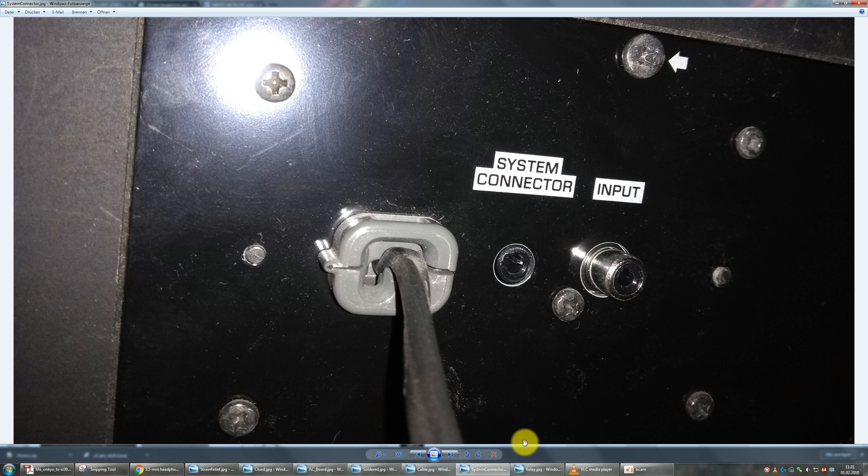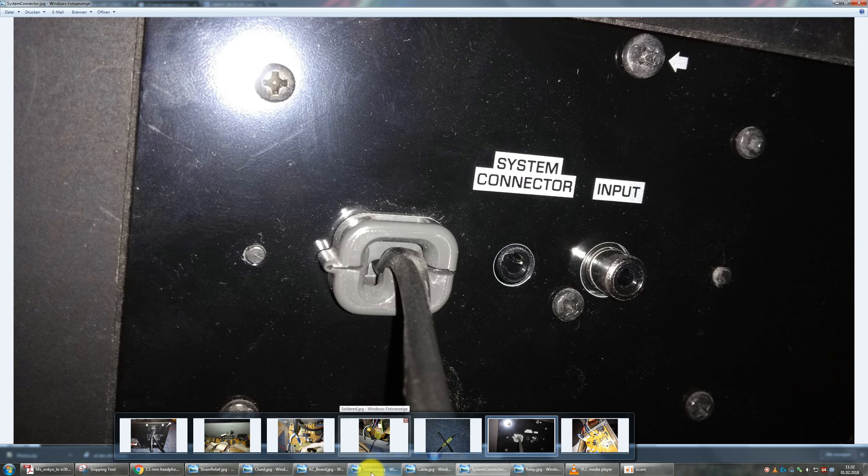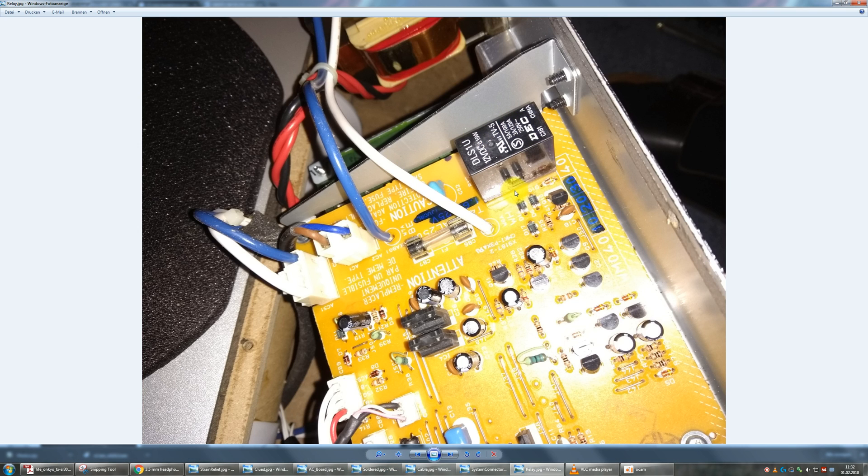If you want to try it out, you don't have to use power from the amplifier — you can also build your own little setup that provides 12V. I don't have any official specifications about this connector, but since it's more or less directly connected to a typical 12V relay inside the subwoofer, you should be fine with anything from about 9 to 15V. It's rated at 0.15 watts, which works out to something like 12 milliamps, but in my case it consumed only about 6 milliamps. So you just need a source capable of providing that kind of power, and almost any source will do.